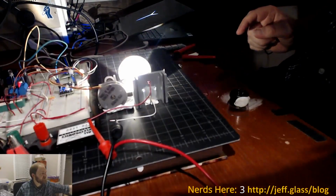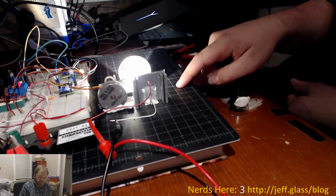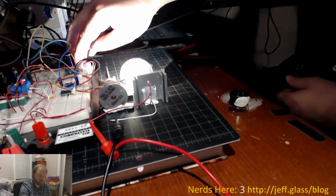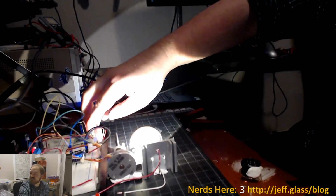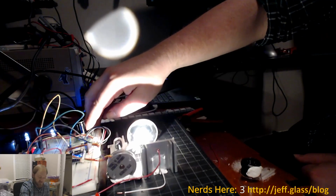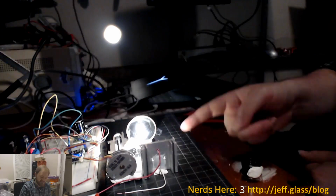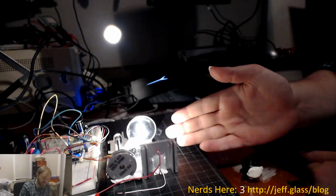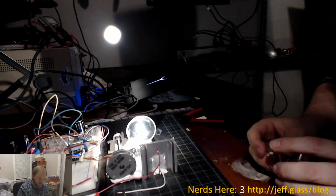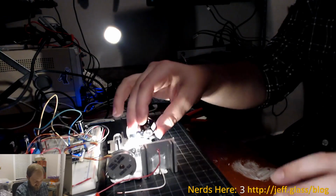Let me turn the current down here. That lens isn't glowing quite so much. This is all just stray light that's coming straight out of the emitter. Right, so you can see the beam too. As I zoom in, you can see that beam getting narrower. Partly it's just because there's a lot more light that's just not hitting the lens. All of this space is still illuminated and just not used, which I think is contributing. Earlier these lenses were contributing toward the primary focal lens, but they were also distorting the optics in a way that was not super fun.